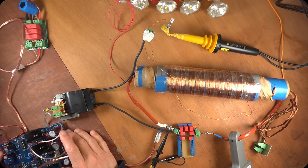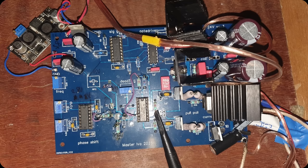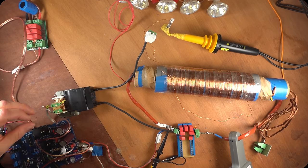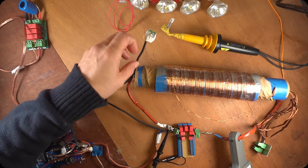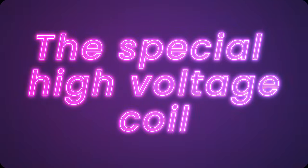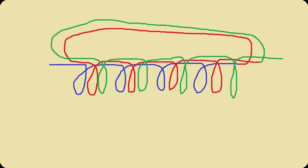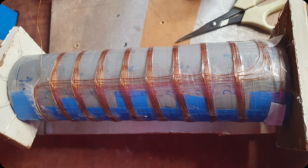The experiment. This is the experimental setup. This PCB is all made by myself, designed and debugged. It has a TL494 chip that generates a signal which I can tune. And the outputs are going to an IR2110 chip which drives these push-pull MOSFETs that drive this AC high voltage transformer. The outputs of these are going to the high voltage coil which you can see here, and the other side goes to the high current coil which is inside of the high voltage coil. The high voltage coil is wound in a special way — each layer has two centimeters separation and it is wound back and then filled up until it's complete. This has an effect on the displacement current direction so it can more easily mix in with the magnetic field of the high current coil.